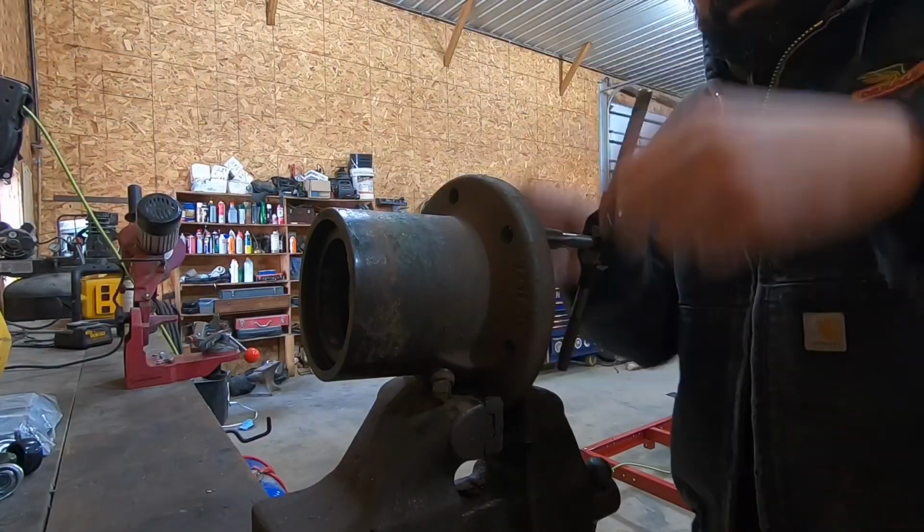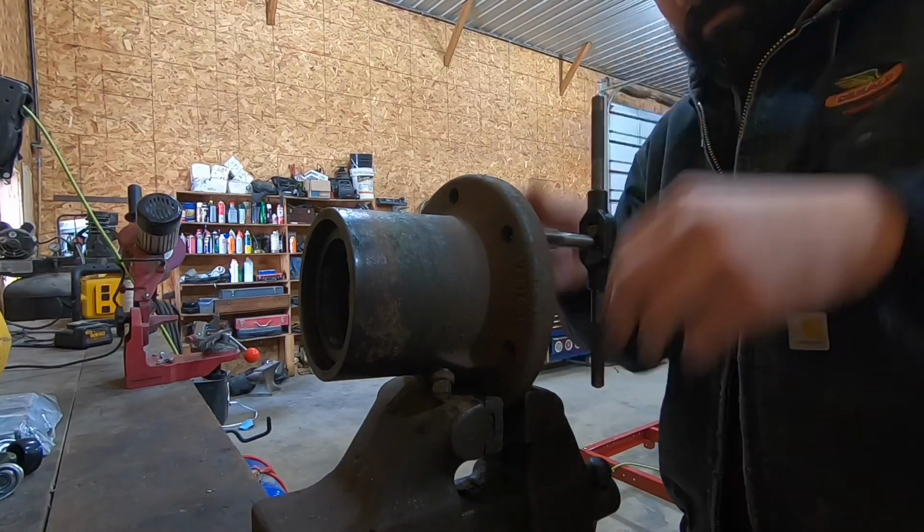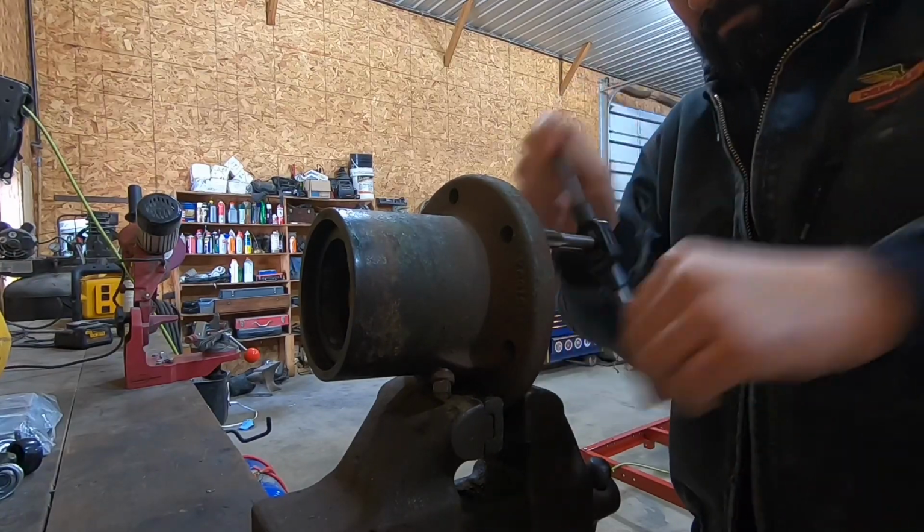We are once again gonna have 6 lug bolts in each one of the front wheels. We only had 4 in the left front and 5 in the right front. So that's a big improvement. Maybe with a loader on the front carrying round bales around, it'd be a pretty good idea to have all your lug bolts. I did stop in town and pick up a tap that was perfectly sized for these lug bolts so that I can clean the threads out. Some of them were pretty rusted up and nasty. This will be really nice.